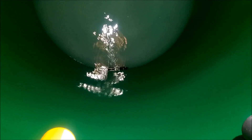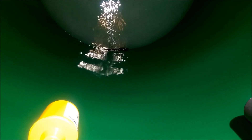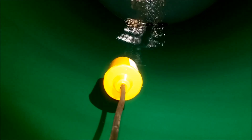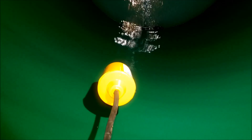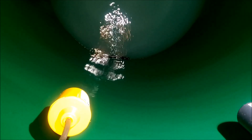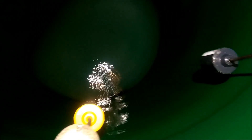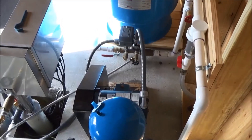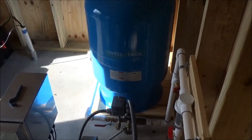I've got two flip switches — one for the submersible pump and one for the 24-volt simple pump option. The yellow one is the reverse logic float switch for the simple pump; the other is the regular. Two ways to fill this tank. First time pumping water from this well — it's a little cloudy but it's pumping beautifully. We tested both float switches and everything checks out.